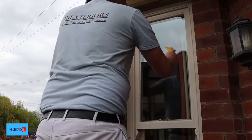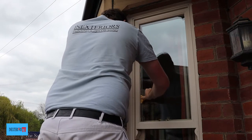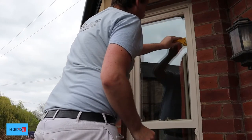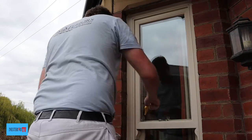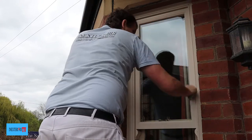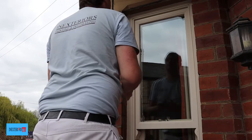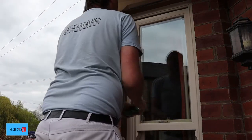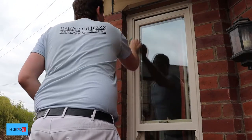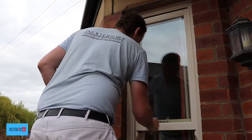What I do first is run the window blade around the cutting-in bit where you're cutting to the glass, because that bit — the decorator's lip onto the glass — needs to be nice and tidy. That bit can often become loose, so it's a good idea to go around with the window blade first and scrape any loose paint off, then give it a sand. Be careful not to scratch the glass with the sandpaper. Once I've dealt with the beady bit against the glass, I'll sand the faces of the window and give it a good dust off with the dust brush.